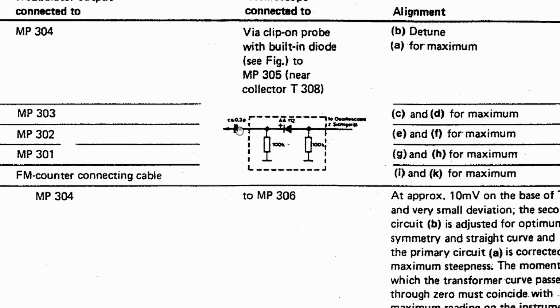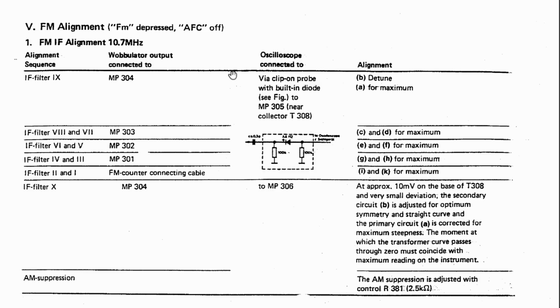They've got a 0.3 picofarads. Now, 0.3 picofarads is actually rather strange, but it looks like one of those loose couplings again. And we will see that it basically is when we look at the board layout. So that's the first step. And now we follow instructions.